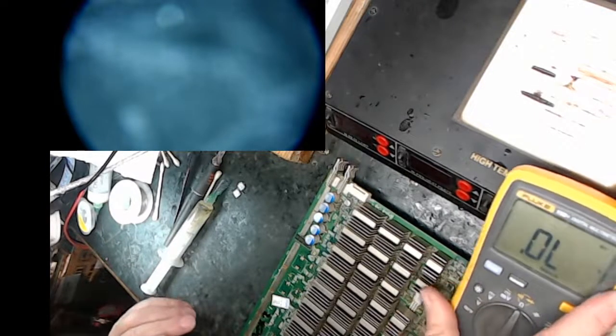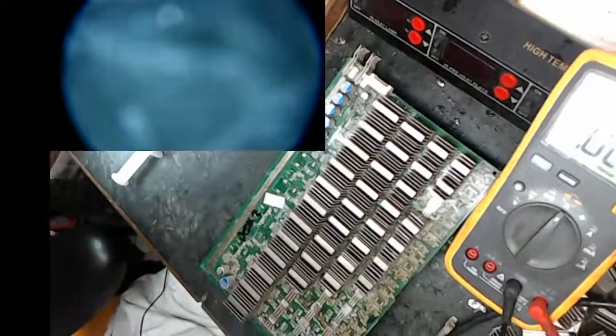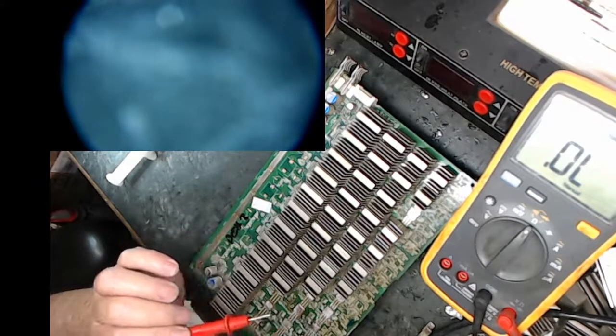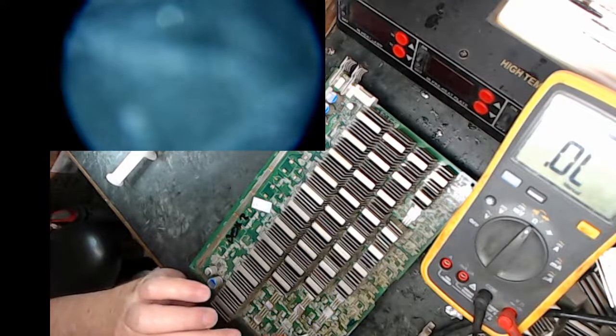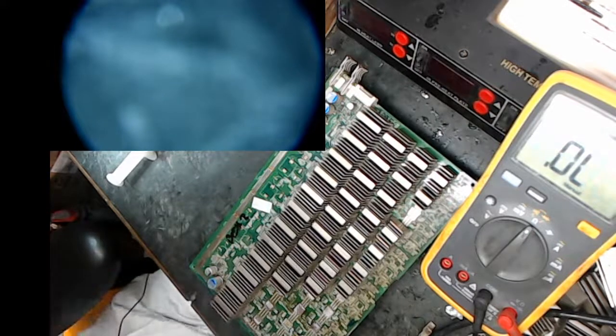All right. So you can kind of see that. The first thing I'm going to do is measure off to the right of the chip we replaced last time. Still really good. So these guys in between the two chips. Let me see. You can't really see where I'm measuring. I'm measuring the chip. So we set this chip just a second ago. I couldn't measure in between before because if there's no chip there, I get bad values. So I put it on. Now I'm getting good values. On hot, it shouldn't be 1.2. It's actually 1.0.